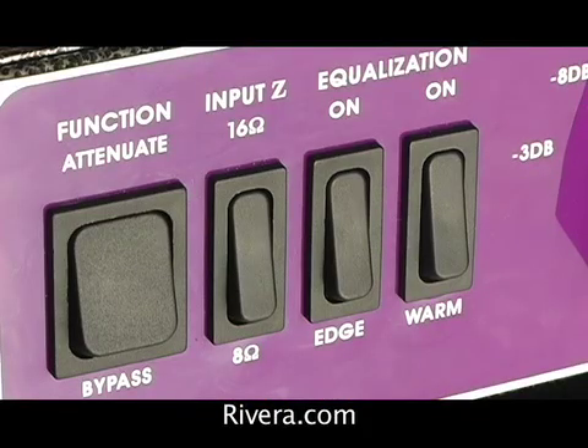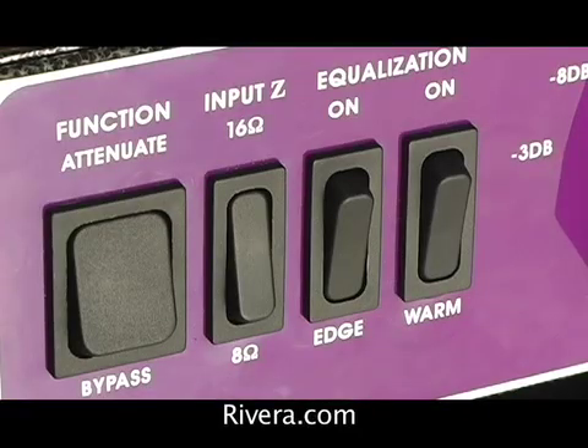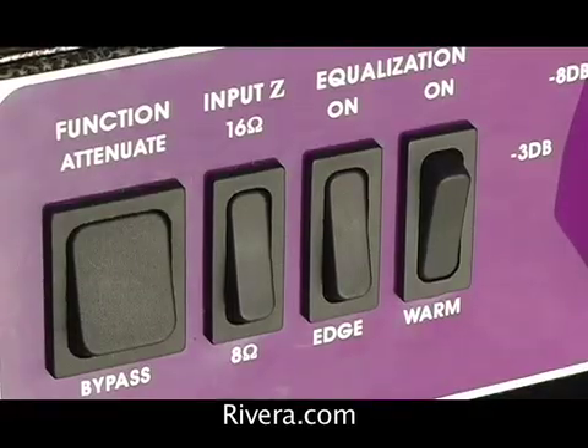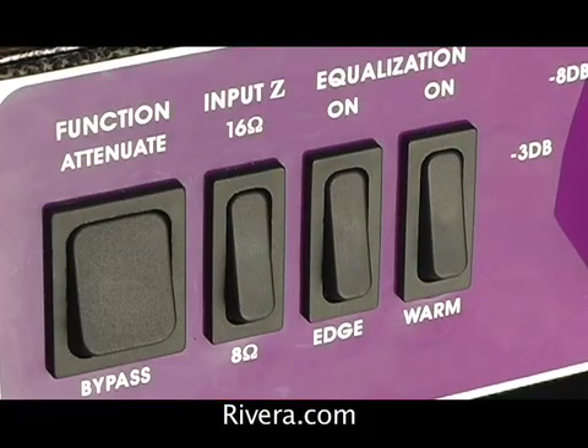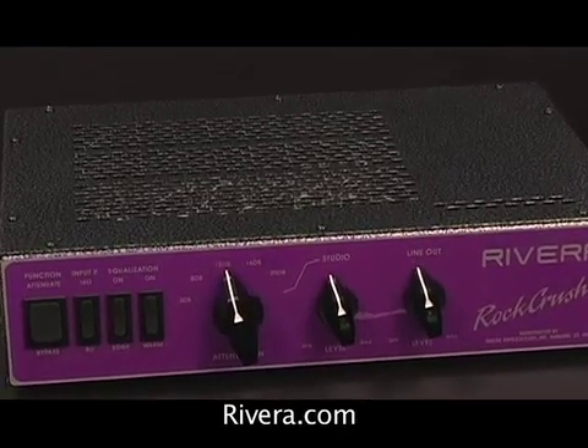On the front panel, we have a bypass switch. This allows you to go from an attenuation mode to a bypass — and it's a full bypass, which means there's no load on the amplifier other than what you plug into the speaker jack. We have three switches. We have an impedance switch which allows you to choose either 16 or 8 ohms, which is a first as far as I know in a power attenuator — great for guys with 16 ohm or 8 ohm cabinets. We have a switch called the Edge, which adds a nice shimmer and high-end feel to the speaker, similar to hearing the speaker wide open without the power attenuator. And we have a Deep switch, which restores some of the bottom end lost during attenuation — it decreases the damping factor, increases the low-end level, and it just sounds wonderful. So it's got a full-featured front panel of everything you need in a power attenuator, as well as a load box.